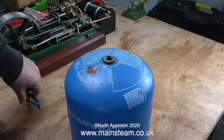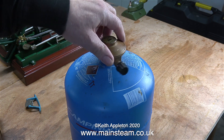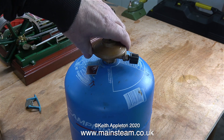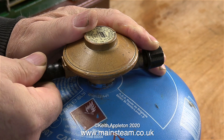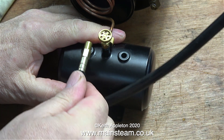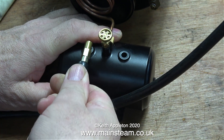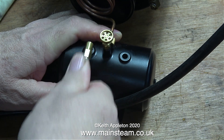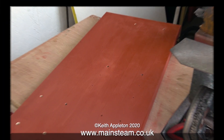This is a large camping gas cylinder and I'm going to try it with one of these regulators — I've never tried one before. This regulator, if it detects too much gas flow, will knock off, which is always a good health and safety feature — it just stops you blowing yourself up in the workshop. I'm fitting some thick-walled silicone rubber tubing first to the regulator and the other end goes to the gas tank. I use this tubing frequently for steam lines, airlines, and gas lines, and pushing it onto the adapter in the tank is a much better idea than threading it onto the thin pipe that goes up to the burner.